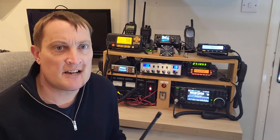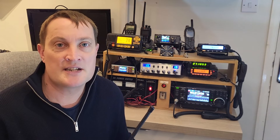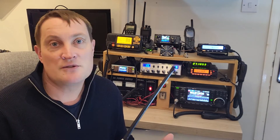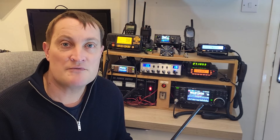FT8CN Bluetooths between the phone and the radio itself to send and receive, but to receive it'll just use the audio — a bit like when we work SSTV, the app will just hear the audio. So simply done: run FT8CN, set it on the correct frequency. This also works on 17 meters and 15 meters, and I was quite impressed with the results that we got.